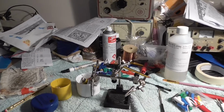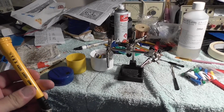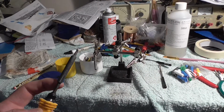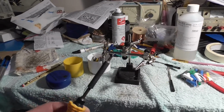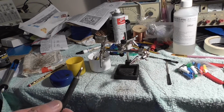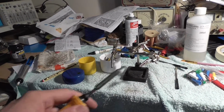Now there's one thing I want to say. I changed over to my 25 watt iron because I wanted a faster recovery rate, but we still struggled. The reason we struggled is we needed a bigger bit to hold more heat so that we could do our job without the joint going cold on us, which is what happened during the making of this video. So the right idea, putting the bigger wattage iron on, but we need to sort out something about this bit. I was getting better results with the 18 watt iron that had the bigger bit because there was a bigger reservoir, as it were, in the sides of the bit to hold on to more heat that we can use on our job of making these leads.